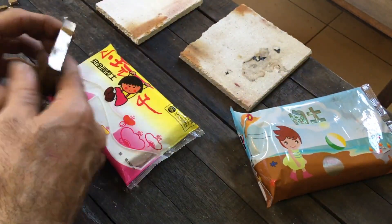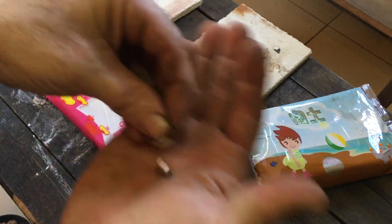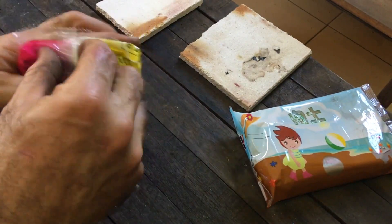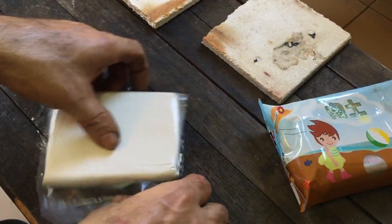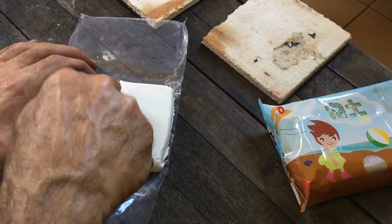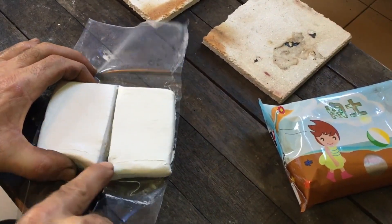It's been a long time since I tried to cast a small bit of copper, so I'd like to have some fun and give that a go. This is a piece of brass, and I'd like to put little insets into this copper casting just for fun, to see if that'll work. From what I've read and from my very limited experience, pure copper is very difficult to cast, but that can be improved with the addition of certain things — one of those being zinc. Brass is made of copper and zinc, so adding a little bit of brass should help with the casting.